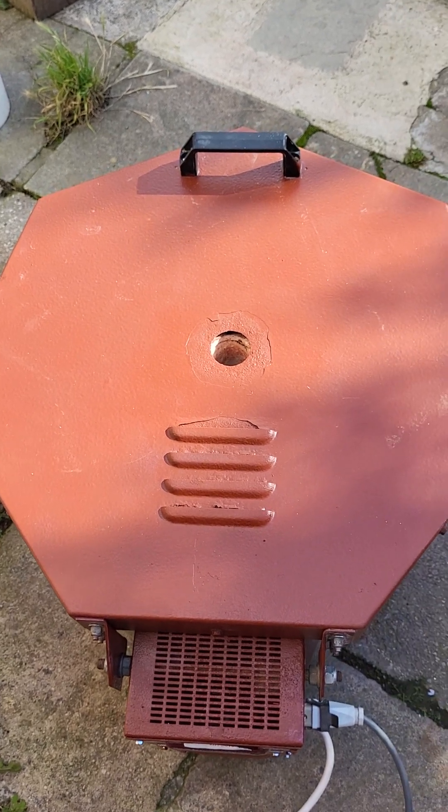When you lift the kiln lid, you will have to press this and lift the kiln lid. This is where the controller is going to be plugged in. This is a Pottery Craft controller ST3300 with one program. To plug this controller, you need to match these two screws as you can see, lift this up, plug it in, secure it. And then you can plug the kiln into a 13 amp main socket.